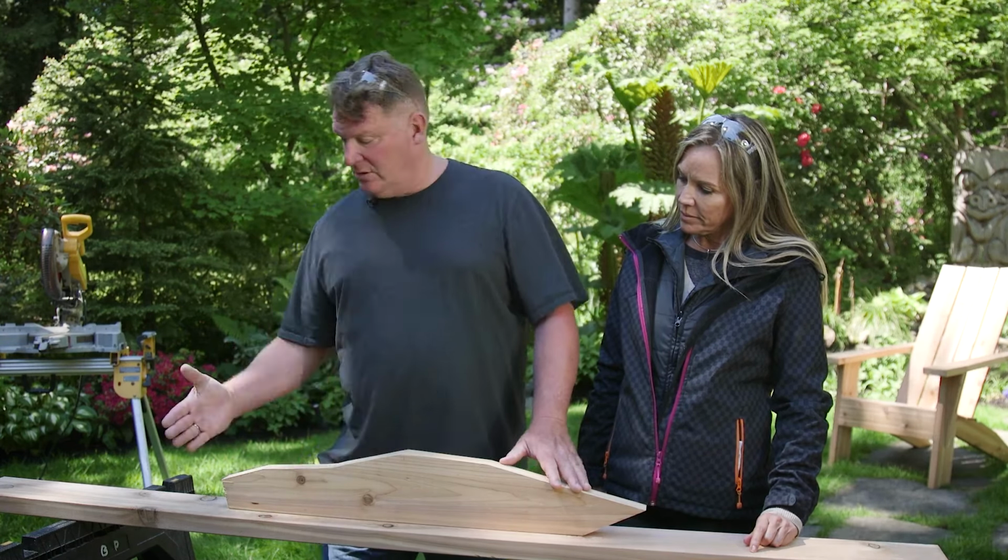This cut, which is an internal cut, you're cutting into the wood from 2 sides. I use my skill saw, I come to that point, but I hold it back and leave it a little bit, and then the round of the blade will leave a bit of material as well. You take a handsaw later and just cut those out. And that's about it. So as long as you're careful in the layout, it's fine.